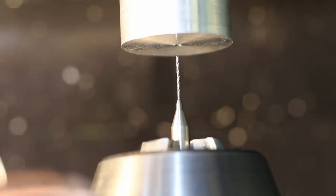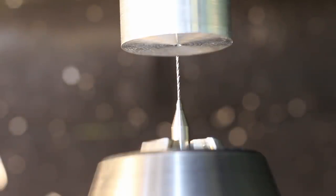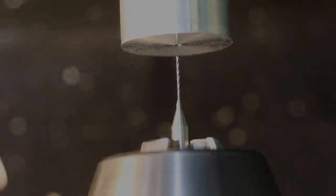I've drilled hundreds and hundreds of tiny holes with the lathe in this configuration and this works for me. As always when I show a technique it's from my perspective. I'm not somebody who gets broken hydraulic cylinders in and needs to repair those - in my shop I mostly make small intricate parts. So that's drilling with a very small drill. We also have the option of power feeding of course.